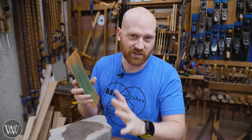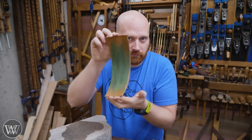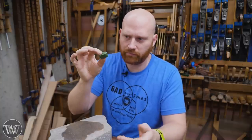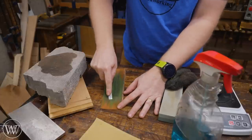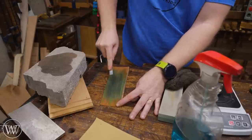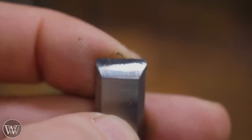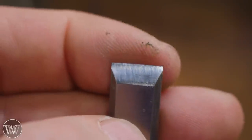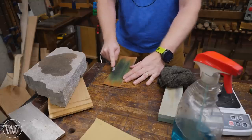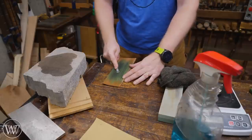I'm going to move the stone out of the way and bring in the strop. This is a scrap piece of leather — you can use just about any leather you want. The harder the leather the better; I like horse butt, which is what I actually sell on my website. For the honing compound, I'm using green chrome oxide. It's my favorite — a great balance between aggressive and medium and gives you a nice clean finish, and it's relatively affordable. Because the burr is on the bevel side, we're going to start there, basically polishing up that surface. I don't need to remove all the scratches, I just want a nice polished edge. Normally I'd do about 10 strokes or so, but this time I need to get rid of a few more scratches so I'll do a few more. And that's the surface you're left with — I could polish it a little farther, but I don't need anything more than that. I've got a bit of a burr on the back, so let's clean that off — bring it over the edge, hit the back a few times, and go back and forth to work that burr off.